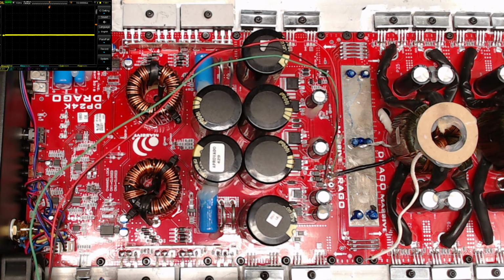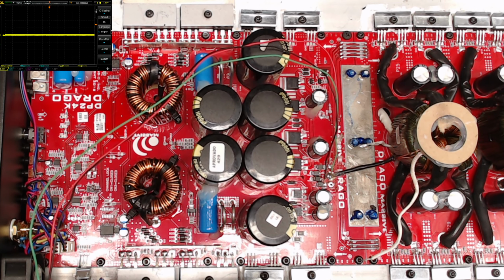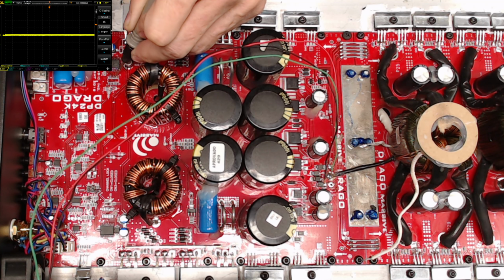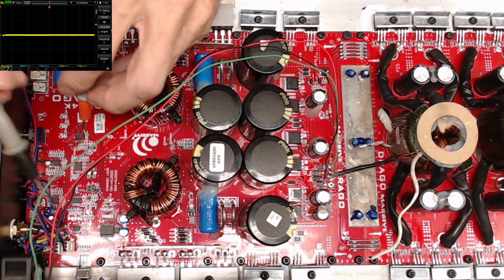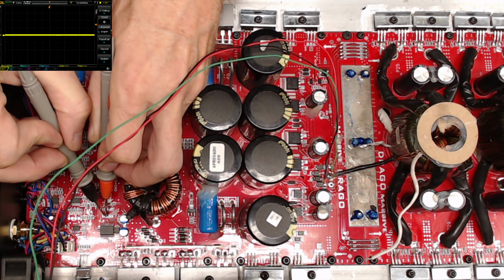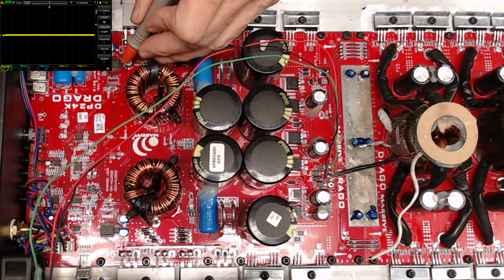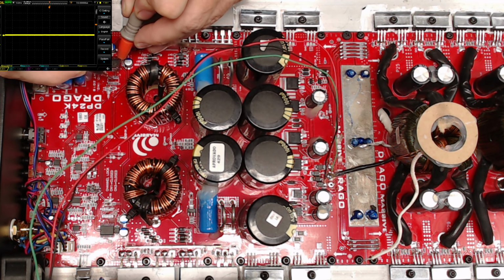So let me put on 2 new flip-flops here. I'm wondering if I should change this drive IC. I will check the resistance. 1.17 megaohms. Let's see what the resistance is between the input pins. So there we go. 0.4 megaohms, so we're at about 400K. So that tells me we have an issue. Oh no, 500, never mind.